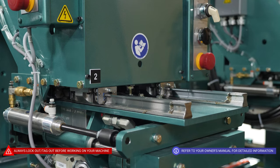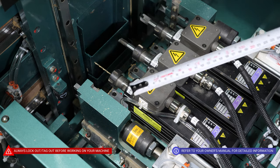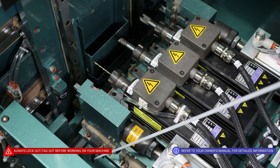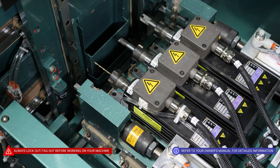On the six-shooter Z-axis, we have four bearings, two per rail, one in the front and one behind it. For the routers themselves, including the chisels, they each have two bearings, one in front and one in back. For the chisels, the Zerk fittings will be on the left side for the left chisel and the right side for the right chisel.